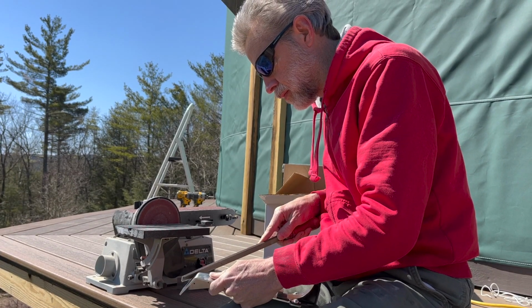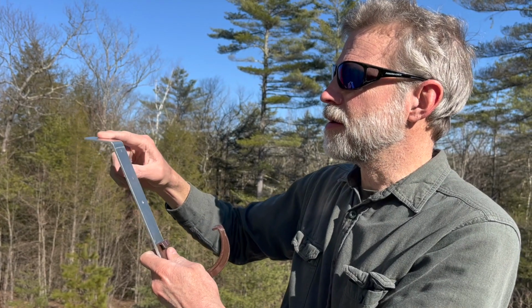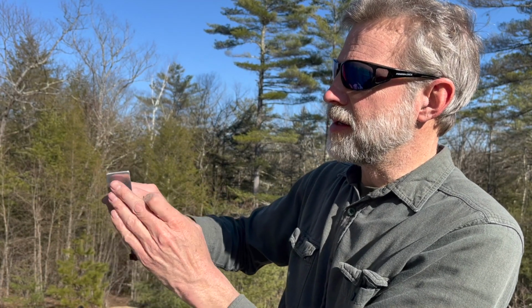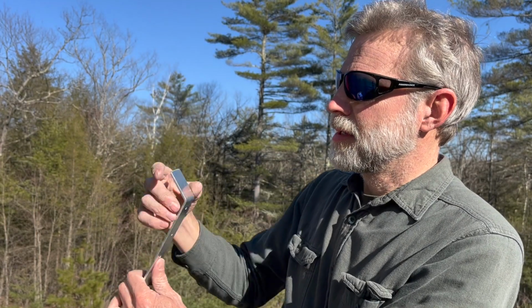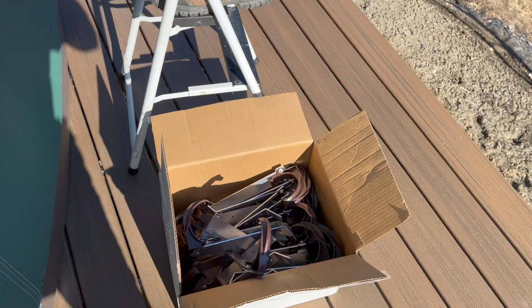It's going to take me all day just to redo the brackets. So I went through and filed all the sides all the way up. This top portion I actually put on the sander and put a rolled edge on the top, so that makes it a little easier to push up. And I rounded all these corners and filed them off so they're nice and smooth.